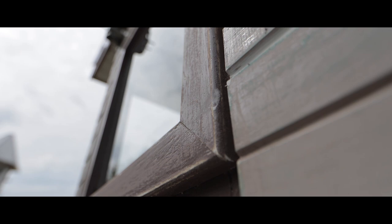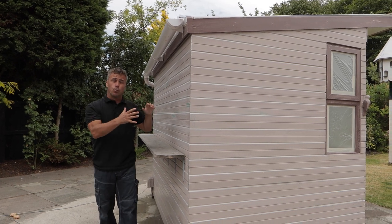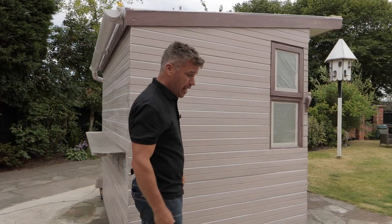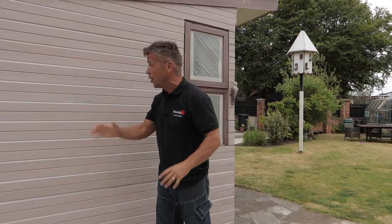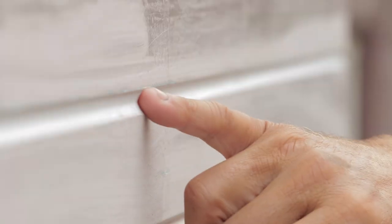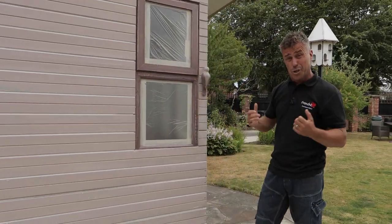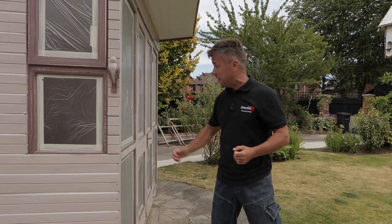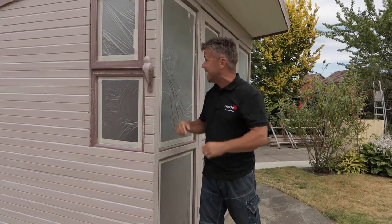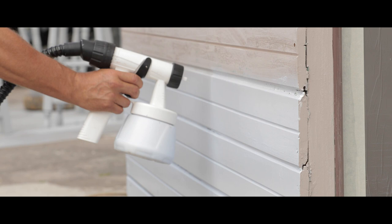I've had this big old wooden summer house in the garden for about ten years, and over the years it's had a variety of different types of paint on it. What Laura and I did was heavily sand it down first, then move to a lighter sandpaper. Over the years the timber started to expand and contract and got little cracks in it, so we put some filler in the day before to let it dry. Because of the vast area we're going to spray it to make it quicker, so I've masked up the windows using polythene masking film and taped around the edges.